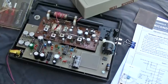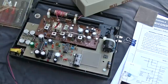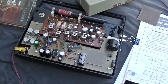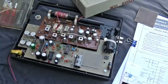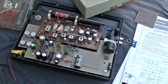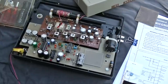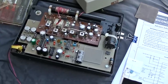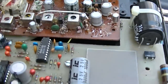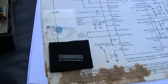In part 2, we took a trip out to Arizona to visit the KYET Cactus Country AM stereo transmitter site, and the station engineer Matt there gave us a good tour of the station. We found out that this radio did not work, the AM stereo demodulation didn't work, and we tried some adjustments and we tried to change the CQUAM chip kind of out in the field without positive results. So he gave me some ideas, and I've also been chatting with one of the engineers at Motorola about this, and we're going to try a couple things today.